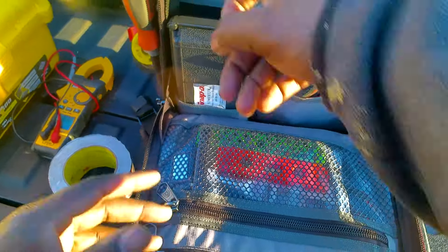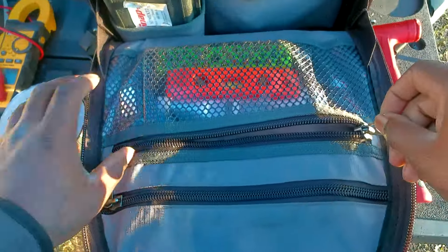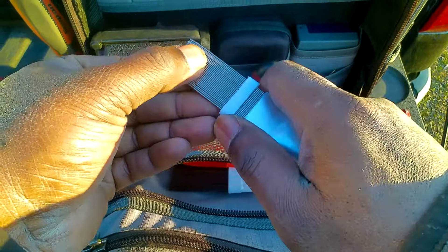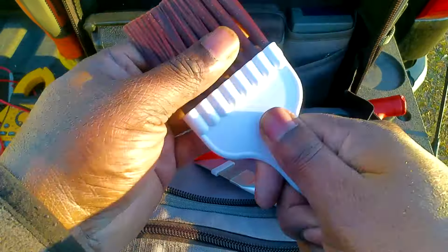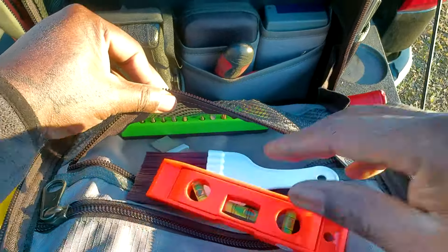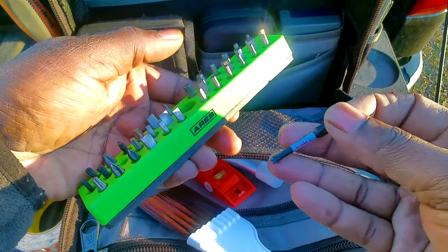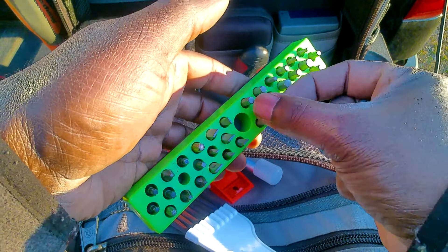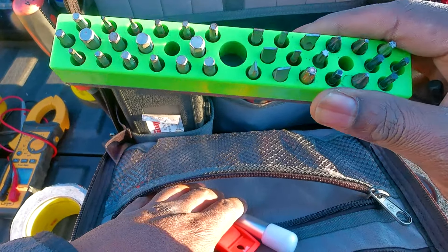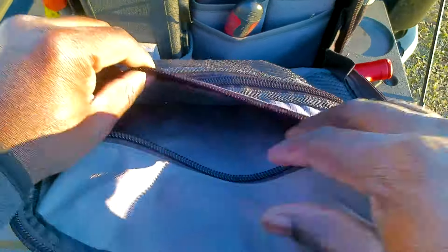I don't use the pockets up top, but there are more pockets and a d-ring and more pockets down here. I have more air conditioning fin combs — one is adjustable for stiffness, you slide it up — and a brush for straightening fins, plus a little level. There's also what I think is an Ares bit kit with hex and other quarter-inch bits to supplement my Blue Point kit. If I don't have a particular torx or hex in Blue Point, it's in there — rarely have to pull it out, but it saves a trip off the roof.